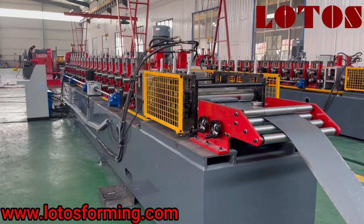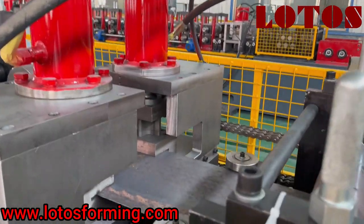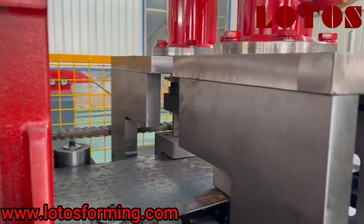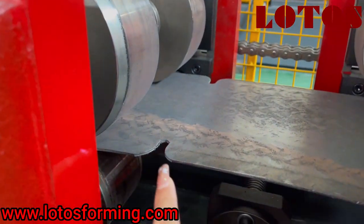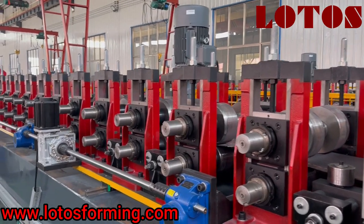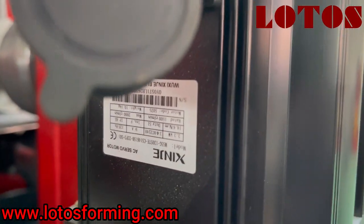Then let's check from this side: feeding guide, two pinch rollers, and then a five-roller leveling unit. Before the notch filling, there is a punching unit with side rollers. We can check the dial at this point to verify the notch size. Since this machine is CNC, all sizes can be changed automatically, driven by this servo motor with a power of 2.3 kW.